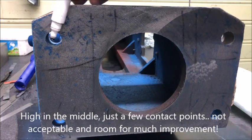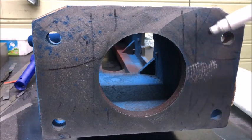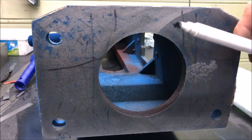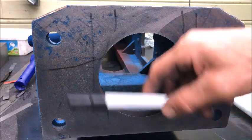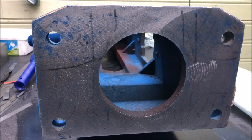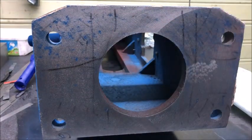We'll improve this by much — I'm pretty certain. We'll correct the tilt down to where we have the bare minimum tilt according to spec. And then adjust and distribute the bearing points better, so that when these bolts are tightened down, it won't distort the column.